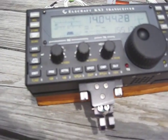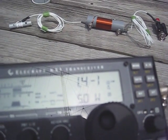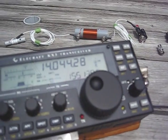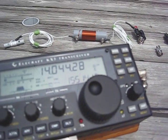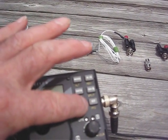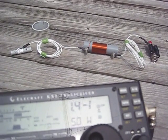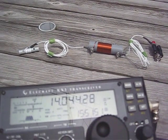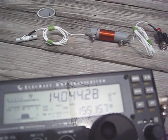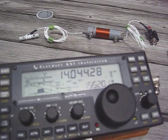I'm going to show you the SWR of this antenna — this is without the tuner. I don't know if you can see it, it's only 1.4 to 1. It's perfect. You're not going to get it 1 to 1, so don't even think of it. Now if you're going to use sideband and CW, use the internal tuner — turn the internal tuner on. Now it's on. Auto. Send again. Now it shows 1.4. Tell the tuner to go — it really doesn't need it. That's still 1.4. You can play with it to get it down if you want.